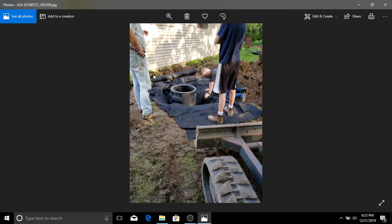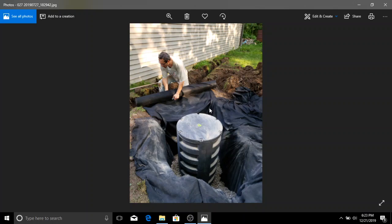You'll notice how much farther away from the garage I am than I had planned — I had planned to put it right here, but there's that big oak stump in there. The stump's right there covered with mud. I left that alone, so I had to skip the French drain over that area. This French drain comes in through here, and the one around the front of the garage comes in around the stump and then enters right there.